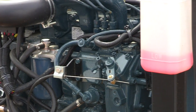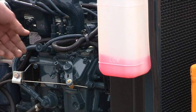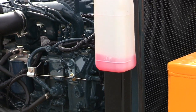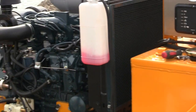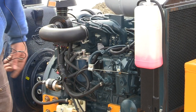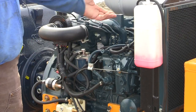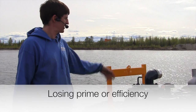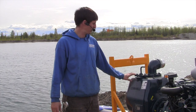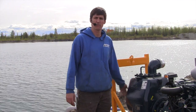Let it pump, and you might want to let it pump for two cycles to get it to go all the way through. Once it's gone for two cycles, turn the key to start it. Let it run for up to a minute with the thumb screw open — it'll run fine. Then come over and close it all the way down and you're good to go. If your efficiency starts going down and you have to reprime a lot before it gets going, check the rubber gasket on the cam locks to make sure they're sealed off properly.